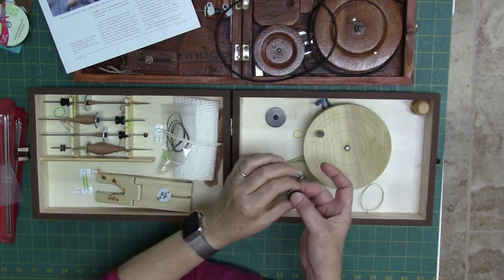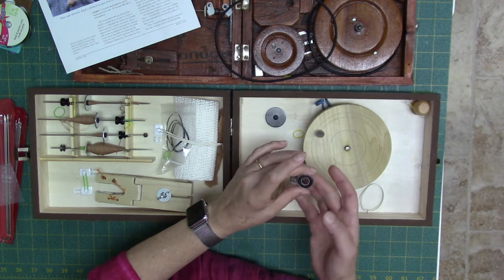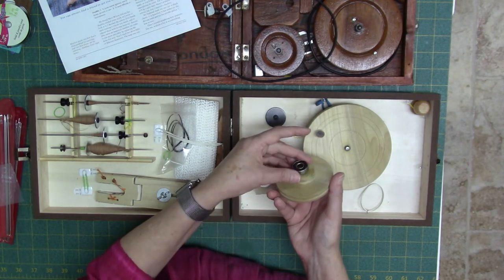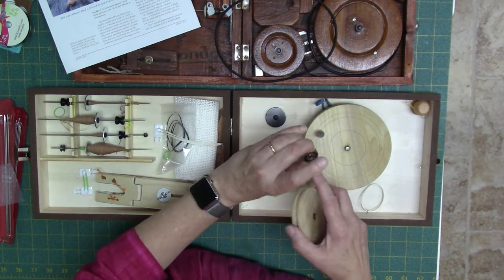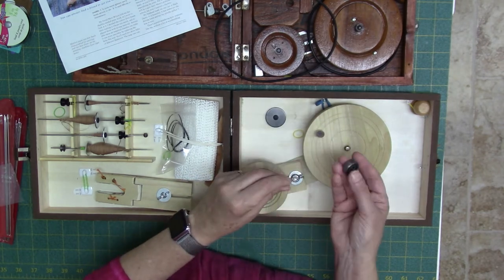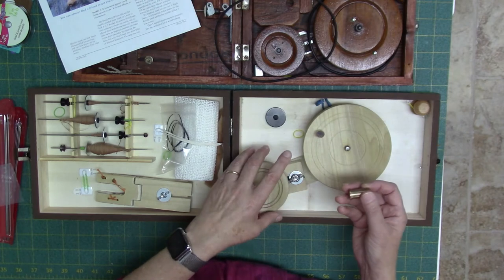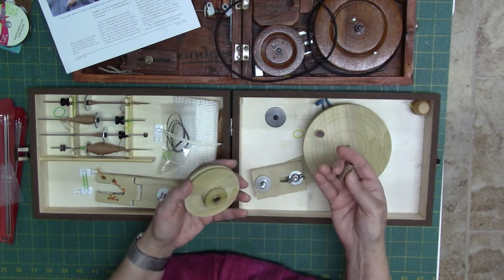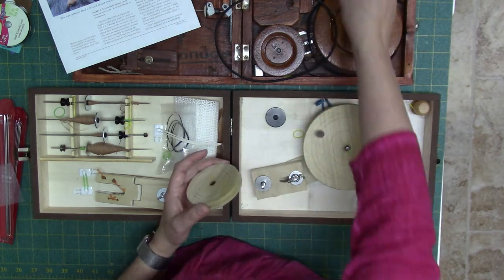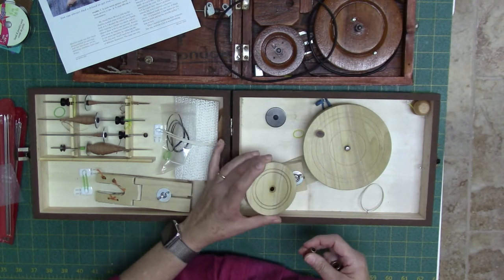The plans I purchased called for skate bearings, which would probably be very nice to use if you used his plans on building the actual wheels. They won't work with mine because they'd be too big. These are not very expensive but you have to buy more than one. What I used was a bronze bearing with a flange on the bottom. Since my wheel was an inch thick, the bearings I bought didn't go all the way through, so I bought one without a flange and cut it down to go through the full depth of the wheel.